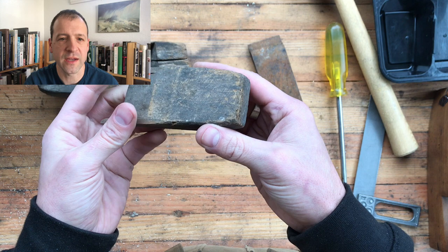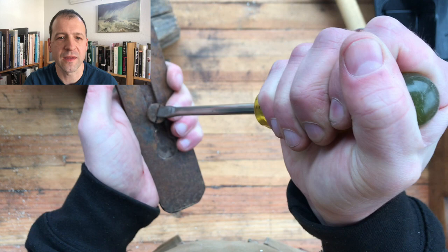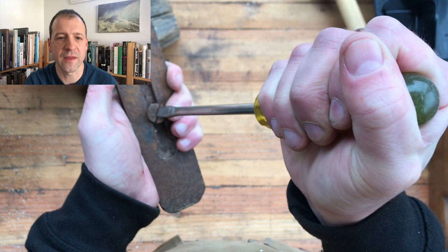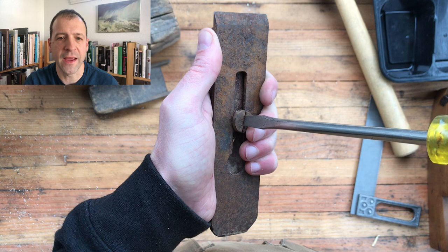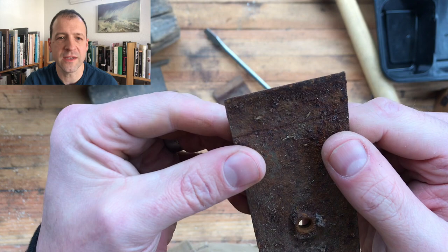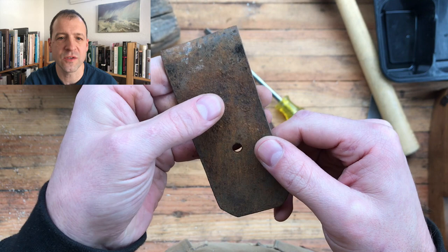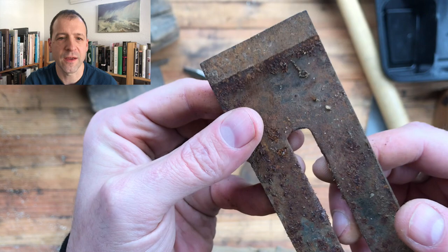The iron had to be popped open — luckily it wasn't completely frozen. There's serious rust all over it, so I expect deep heavy pitting. I ended up leaving it in Vapor Rust for five full days to get all the rust off, taking it out once a day to scrub it and throwing it back in. Surprisingly, the edge of the iron is in pretty decent shape — no huge chunks missing — so it ended up being fairly easy to clean up the bevel and put a new bevel on it.